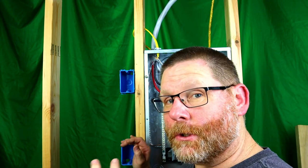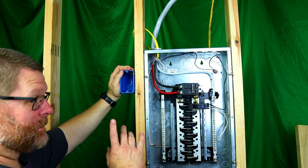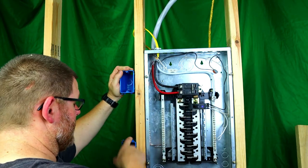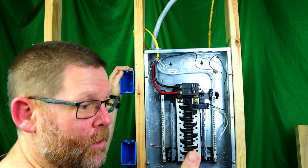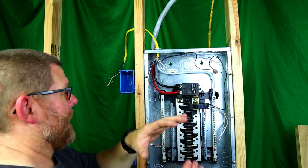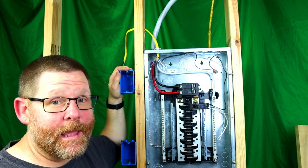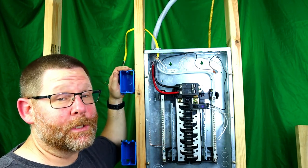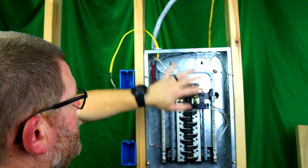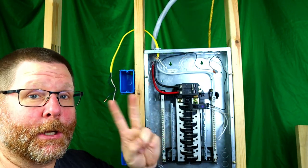If this is a brand new install — which this one's going to be — we're going to have a new box here and a new box here, no wire in between. If there's no receptacle anywhere else and you want this to be a dedicated circuit, we're going to have to get a circuit out of this panel into this switch box. I'm going to show you two different ways — this is going to be a two-for-one video, guys. I'm going to take this circuit, put it on a different breaker, and add it like a new circuit. Start from fresh.